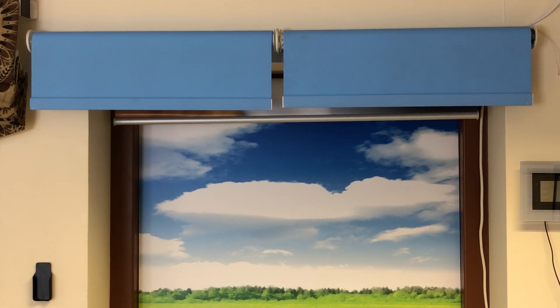In this video we're going to show you how to set the limits — that's the top and bottom positions where the blind will stop. The procedure I'm going to show you could be the same for a Roman blind because the sequence of buttons we're going to press is exactly the same. For CurtainTrack systems you don't need to do this because you open and close and the limits are automatically set, but you can set additional limits if you want — maybe to cut out glare — in which case you would use this procedure.